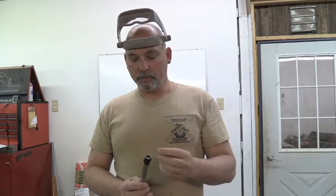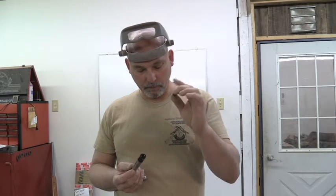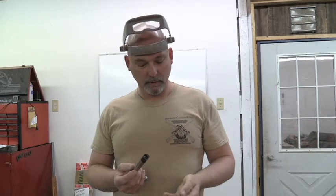I've had a lot of people tell me that they epoxy them in and they fall out. I've had to repair some that guys have put in with epoxy — once you oil your bolt or clean it, shoot it a couple times, that epoxy turns loose and the little ring will fall out of there. So I'm going to go over to the machines and put this Sako extractor in this bolt. When I get it put in, I'll come back and show you guys the end results.